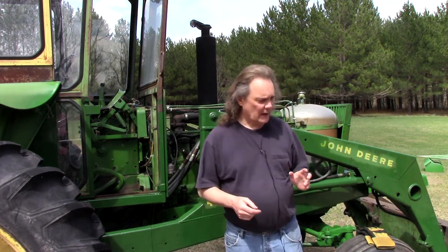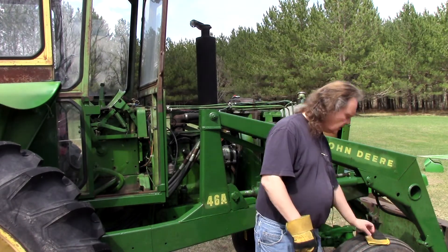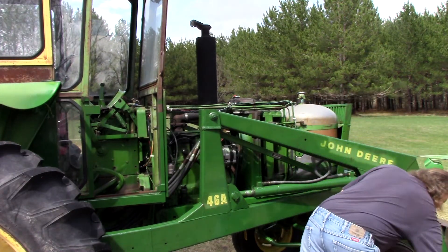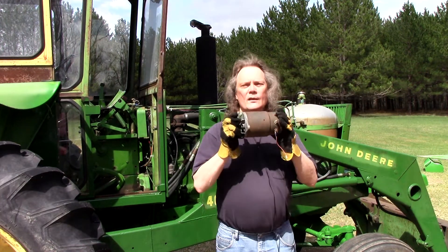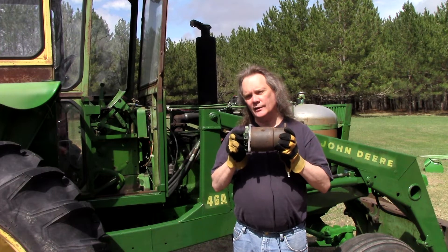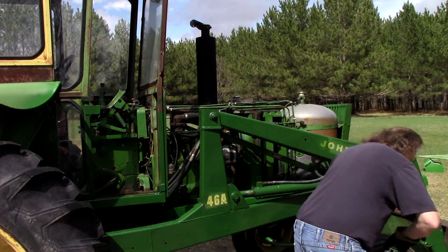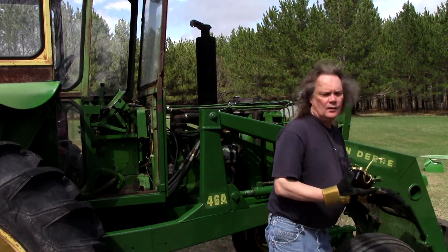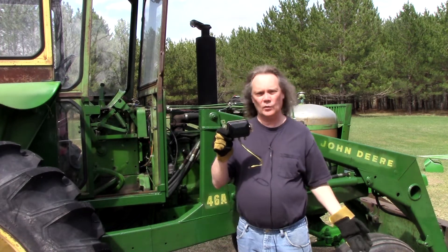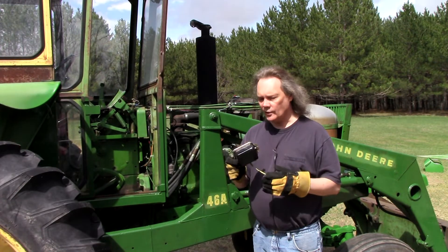The original battery charging system in the tractor uses a John Deere DC generator, which puts out approximately 20 amps of power. It is then connected to a mechanical voltage regulator to control the amount of voltage coming out of the generator that gets sent back to the battery to keep it in a properly charged state.